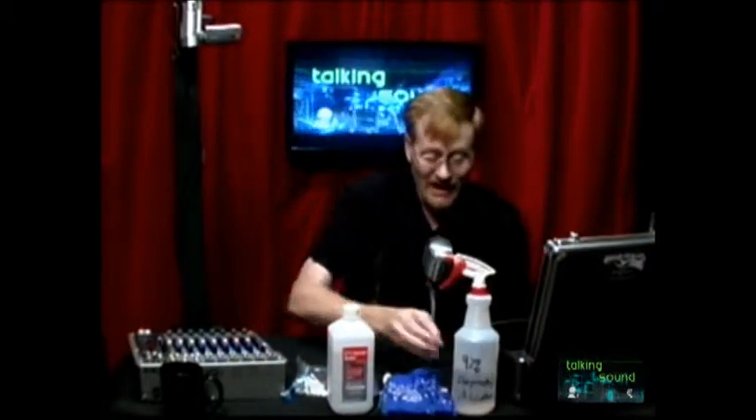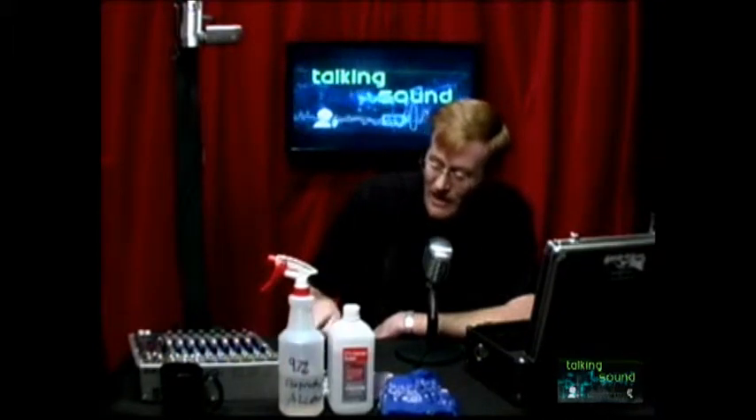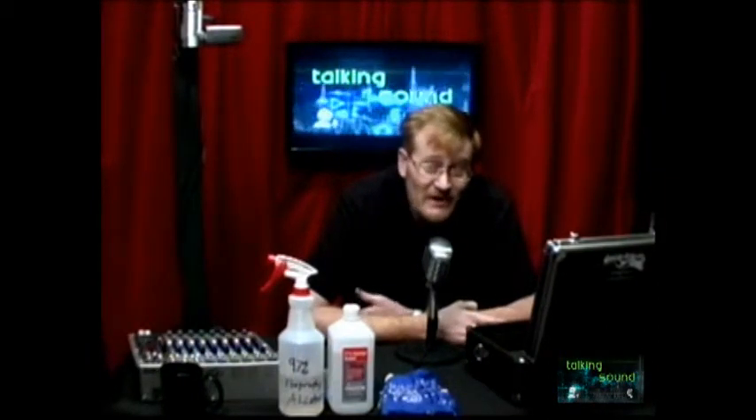90% or higher isopropyl is best. I actually have a little secret weapon that's tough to come by nowadays — the 97% isopropyl alcohol — and it's fantastic. Now a lot of you may be saying you have a big bottle of denatured alcohol in your garage that you use for woodwork. I would not recommend that. We want to stay away from things with volatile fumes — volatility is also what's used to rate how well things take stuff off.